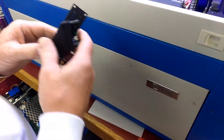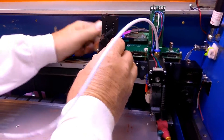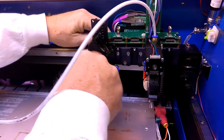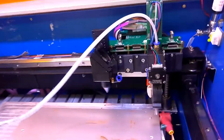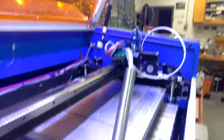Here's my laser head — something you cannot run without. I've already pre-calibrated and aligned it. This is the CO2 laser I'm using today, not the small 5-watt, 6-watt, or 3-watt units — those don't need this. I'm going to put a piece of tape across the inside of this and send it forward a little bit to double-check that my alignment is good. You never know who's been playing with this — trust but verify.